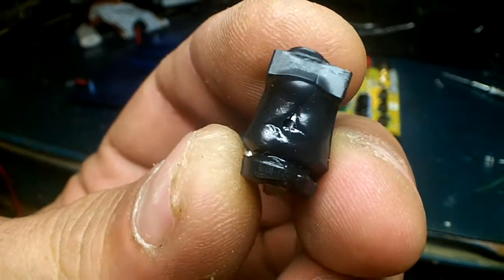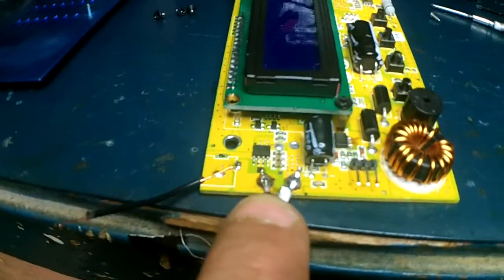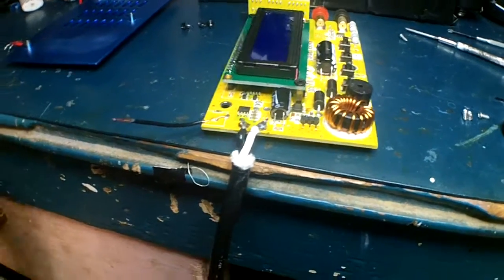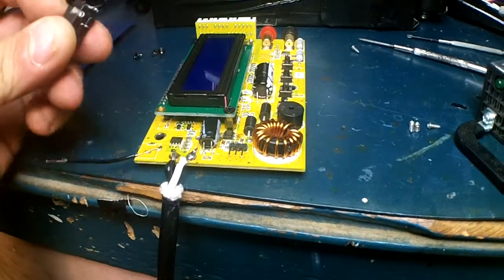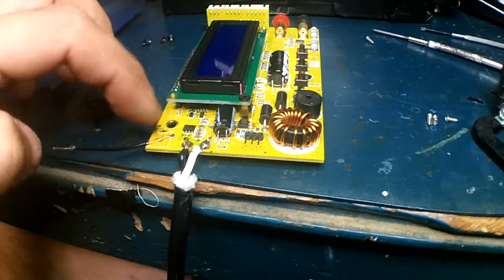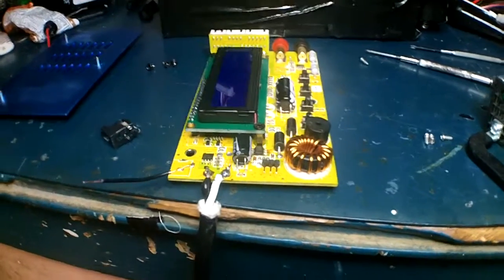You can see the top's melted pretty good. There are already pads on the board that you can add a wire to, which I'm adding here, coming out. But the thing is, when you move the jack, the side pin and the front pin have to be bridged, or else it'll give you a volt error.